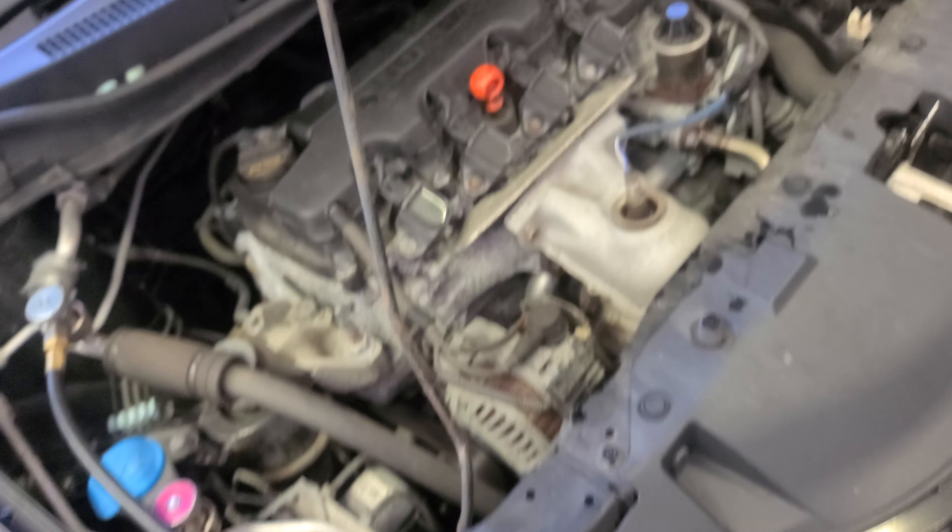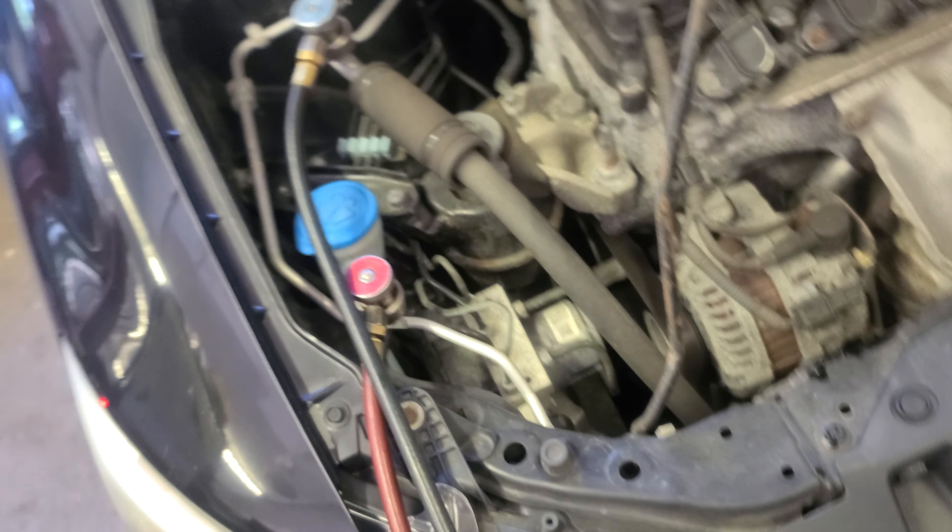In the meanwhile while you're recovering whatever is in the car, you look for the sticker that tells you how much freon this car takes. There's one right here. This one says recommended charge max 15 ounces, minimum 13.2 ounces. It also tells you the type of system — it has R-134a, which is a classic system.